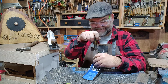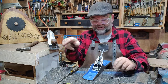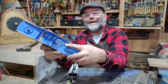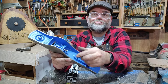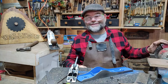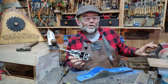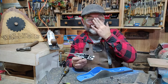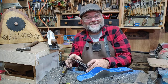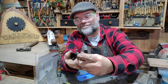These things are sent to try us! It really is a nice thing. A good idea is to have a magnetic dish — mine is already full of stuff. I need to remove the actual frog itself now, and the adjuster screw for the frog. I've cleaned it all up, it's all oiled and ready to go. I cleaned it up using this wire wheel here — well worth using. If you haven't got one, just use a wire brush and a bit of sandpaper. You can screw the frog down to a piece of wood to use both hands and get a bit of welly behind it. Just mind you don't bend your adjuster.